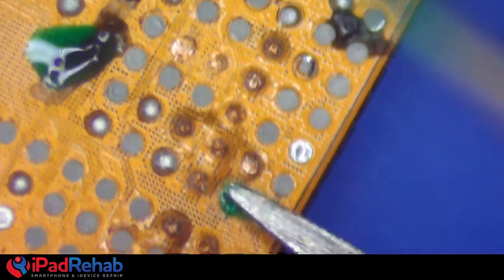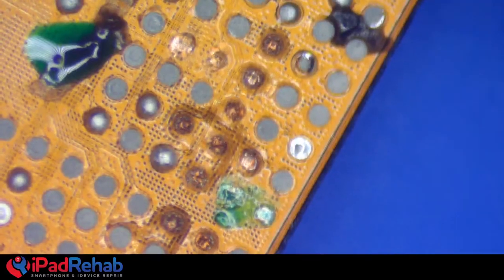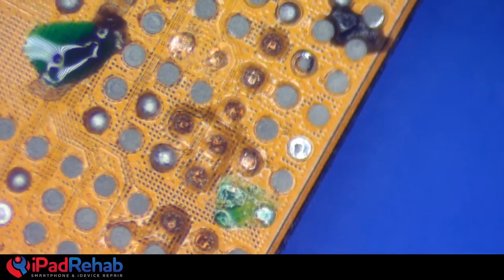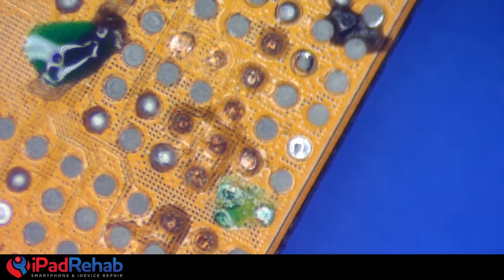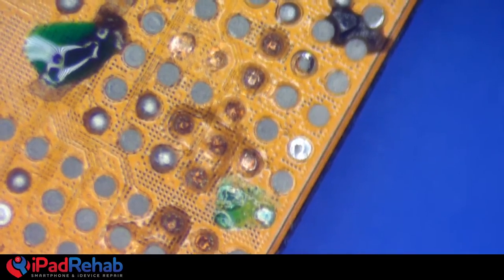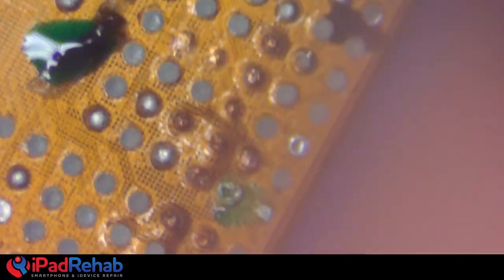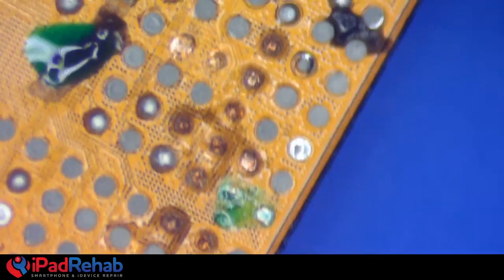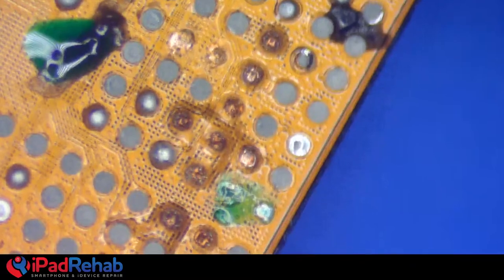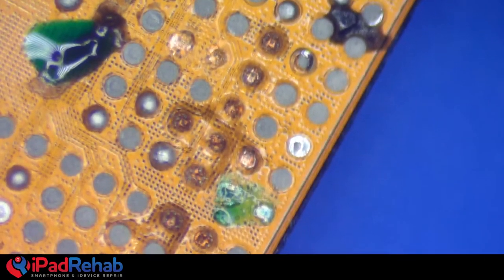over the look. All right, so what are we doing here? What's the point of this? Just to get a tiny, tiny bit of it in the center of that hole, where the missing pad is, because there's ground under that and I don't want my new pad to stick to it. Gotcha. All right. So we're going to hit that with some UV real quick and cure it up, and then take it back off of the part that I want to solder to.